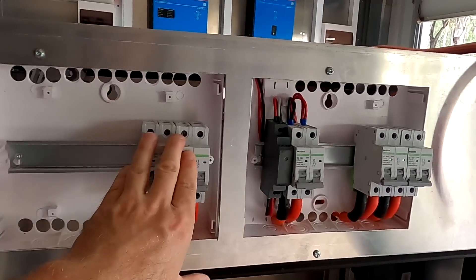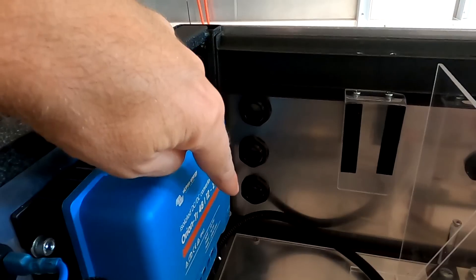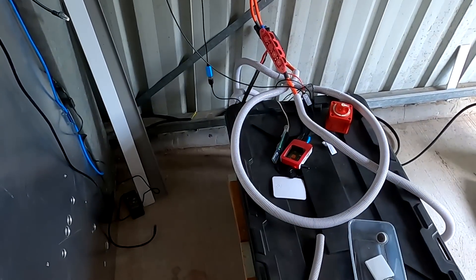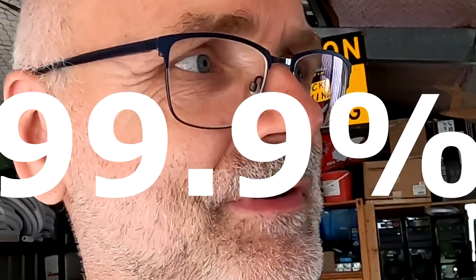I think we are ready — I know I've said this many times. But now: solar charge controllers done, special load, two mega fuses for the inverters, home of the Raspberry Pi, data cable entries done, bus bar covers mounted, all AC cabling done, DC cabling in preparation, incoming solar installation done. I think we can just disconnect the battery and then push the shelf back in place tomorrow.